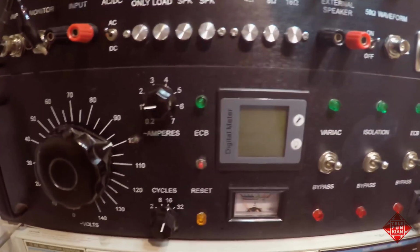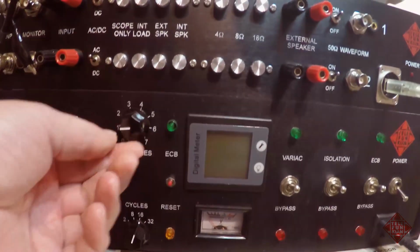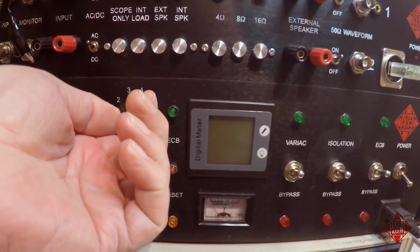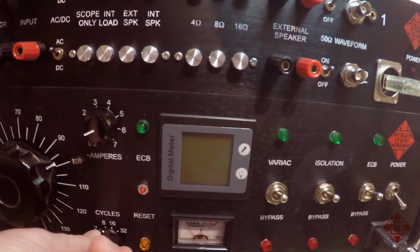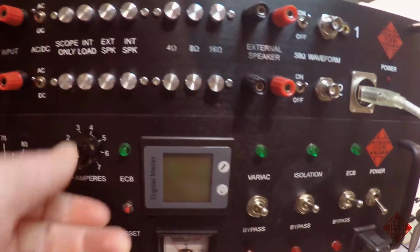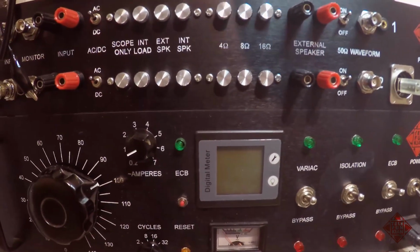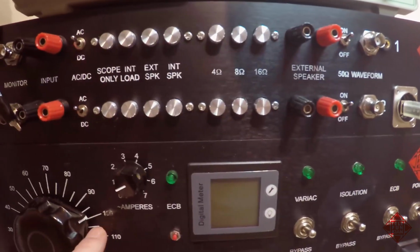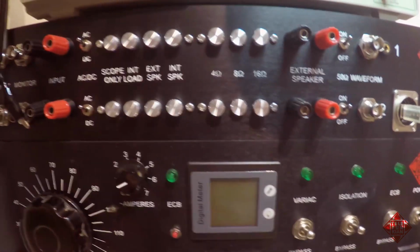And we're also going to be using the electronic circuit breaker. Now this is described in another video on my channel, but essentially what we do is we set the maximum current and the number of cycles that we'll tolerate at that current. And if indeed we exceed the settings, the electronic circuit breaker will break and thereby protect the instrument from frying itself. The variac is currently set at 100 volts, but we'll be turning this up slowly when we turn it on. And we'll turn it on right now.